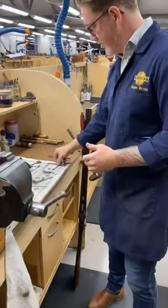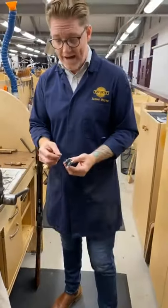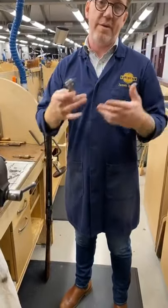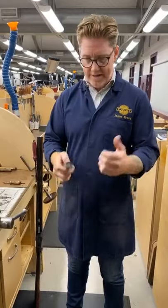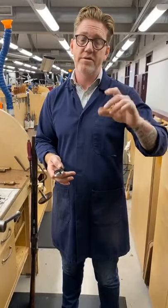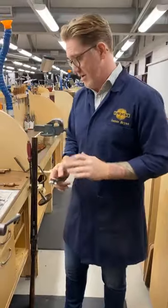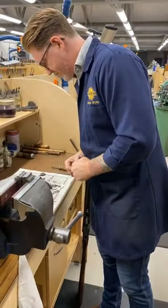And that's what we found, that's why we changed to the center arm, because what the center arm does, and I'll show you now, is it lifts the mainsprings out of the way of the cams. So once they're fired and the cam's fully rotated, with the movement of the gun and the bottom of the action, the center arm will lift both mainsprings out of the way and allow the cams to rotate on their own. So they just get one single wear going forward, and on the way back, they get nothing. They just get a rotation with the extractor.